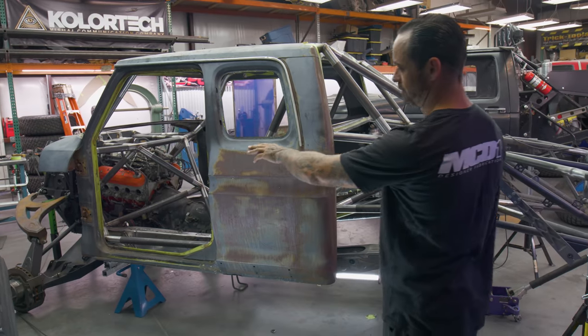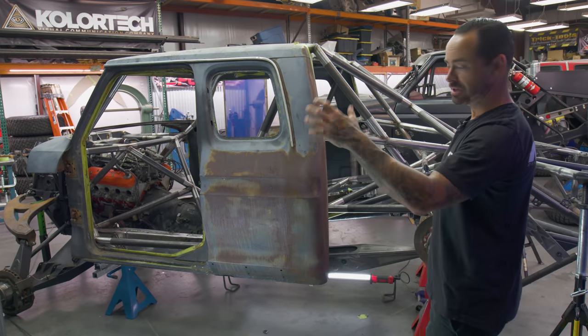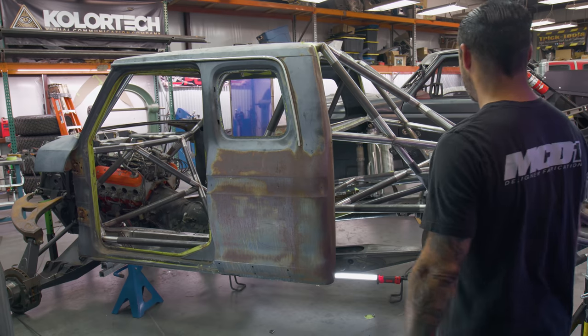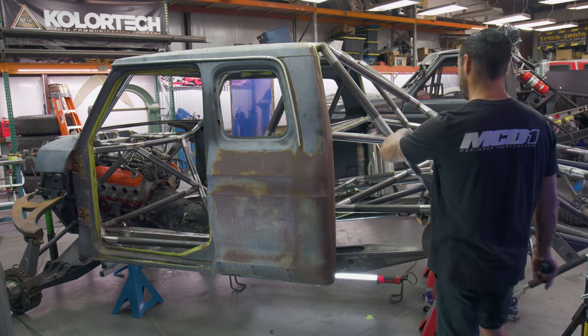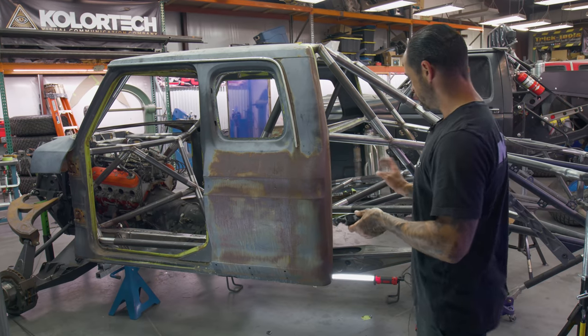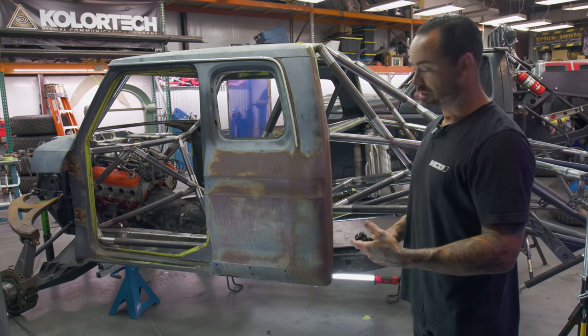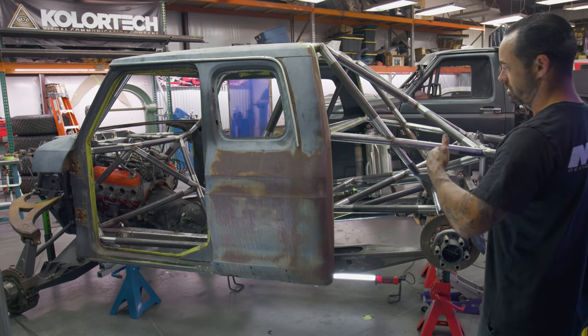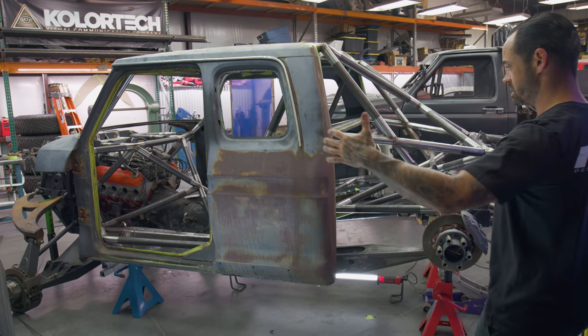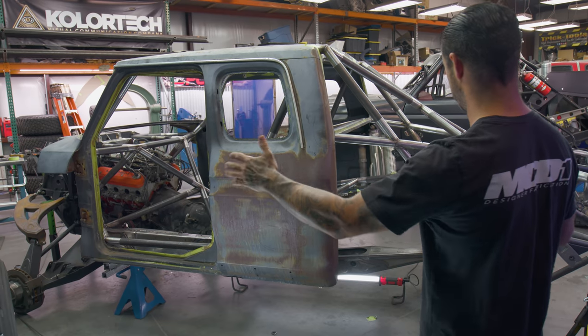Once we had the front wheel and tire centered in the wheel opening where we wanted it and figured out the right drop on the body, it was just bare frame in here and we didn't have any tube lacing yet, and it made sense to just try to get this thing optimal. It was at 135 inches and now it's at 125. We took 10 inches of frame out of it and got this thing where it's gonna have the best chance